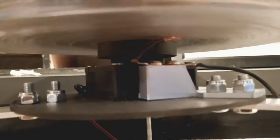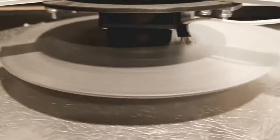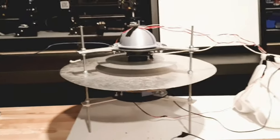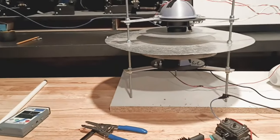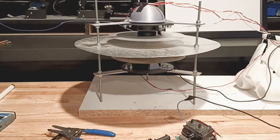Once in a while it's sparking over — it wasn't doing that before. Watch — I'll turn off the Tesla coil and it'll stop. My Tesla coil is now at 19 and I've got no spark over. Going back up to the top — nothing there. So we definitely have a connection between our Tesla coil and the upper and bottom plate along with the center plate. When you go too high on the Tesla coil itself — I like to run it at about 25-30 — I'm starting to affect the high voltage circuit.